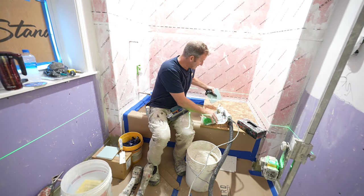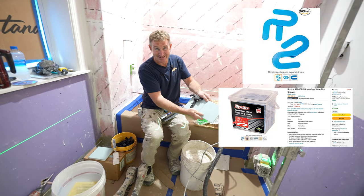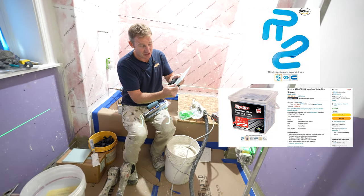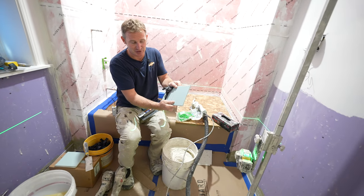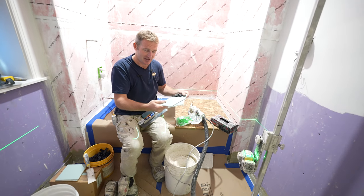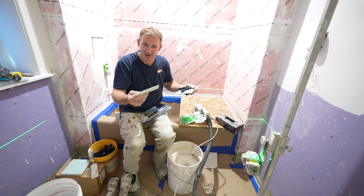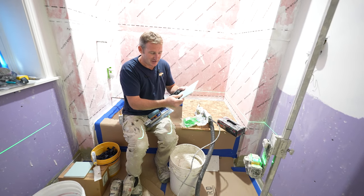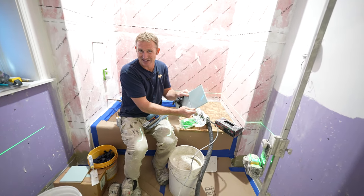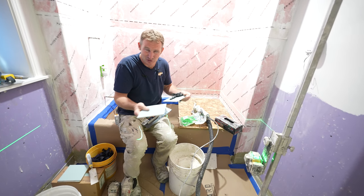Now these 6x6s do have these little notch bump outs, and you could butt them directly to each other, but you're going to get less than a 16th inch grout joint. And I really want to see the color in those grout joints. And ultimately, I just feel like it looks a little bit better, because in some ways, just having a really small grout joint like that kind of looks commercial. Kind of looks like something you'd see in a commercial setting.